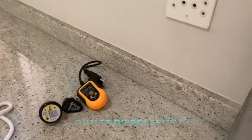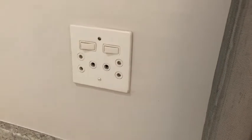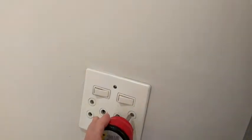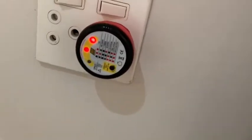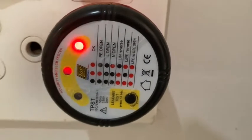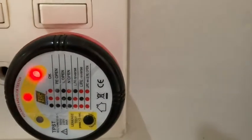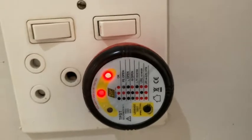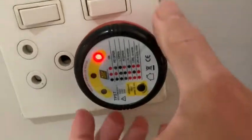Stage one is we have to test the electrical outlet. We are going to be using one of these over here — you see the two lights come on. If you look at it you will see that it says OK; the two lights on the right side are on, it's OK. If both lights are on, great. If not, you have got a problem which you may have to investigate with an electrician.